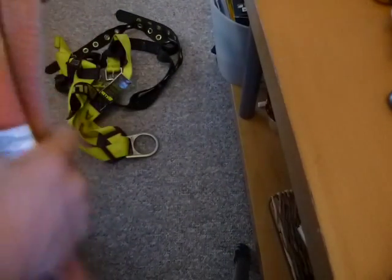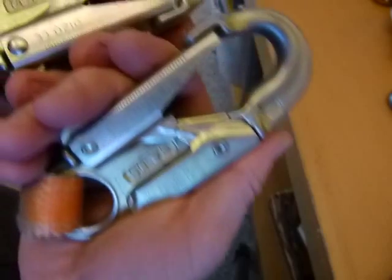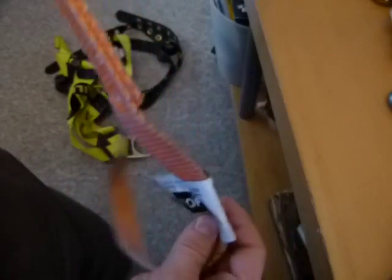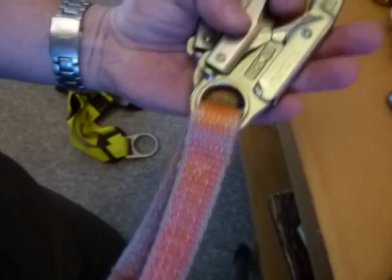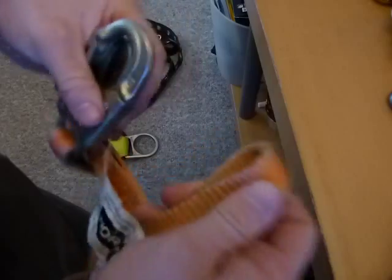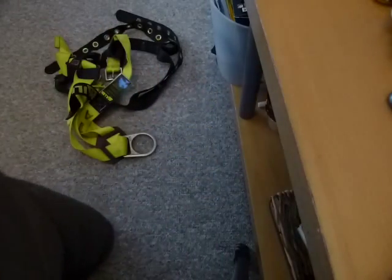Next: a lanyard with special hooks on it. The hooks are not rated — it doesn't tell you how strong they are. The nylon webbing also has no strength number, just the usual warnings, its length, and the date of manufacture. But it's a lanyard designed and manufactured purposefully to be part of your fall arrest system. Its strength: 5,000 pounds — as long as the stitching is intact, there are no nicks, tears, cuts, abrasions, oil spills, solvent disintegration, or embedded sand or concrete.